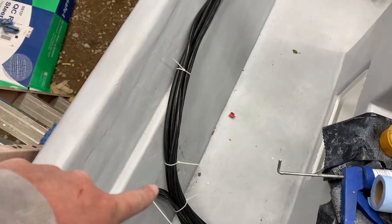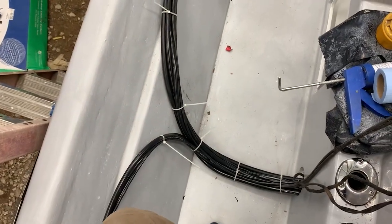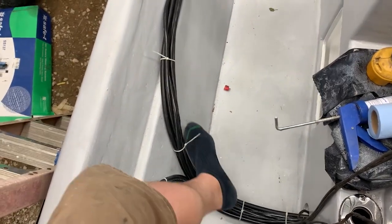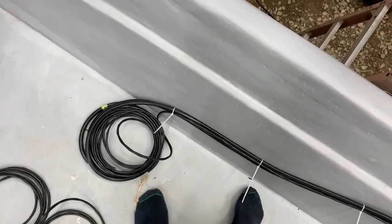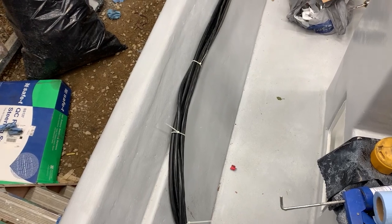I'm having to cheat a little — I wanted to bring things in more cleanly but the control cables and gauge wiring are in the way. I'm also running the big wire for the motor and using the same wire for the trolling motor, because it was only about twenty dollars more to get a big spool that covers both. The trolling motor pulls 56 amps, which a number four would cover, but I'd rather have the bigger wire so if I ever upgrade the trolling motor I'm covered.